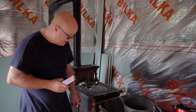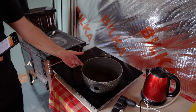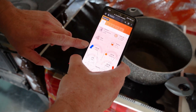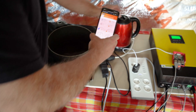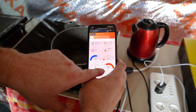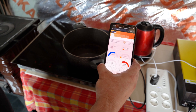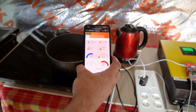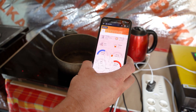So let's have a play around and put some things on. This is an induction hob — it's a very good way to use a lot of electricity. Press this on, press that, and now that's heating. When that goes solid it'll turn on — now it's loaded up there with 1,300 watts, and I can see in real time what's going on. Now I'm going to punish it more by putting the kettle on, because kettles use a lot of power. Now the load has gone up to nearly four kilowatts — you can see the fans have come on because it's pulling some proper power. This will go up to six kilowatts on a steady load.